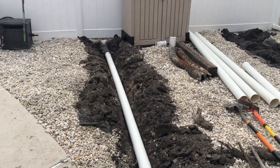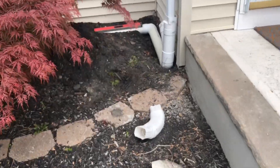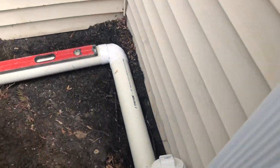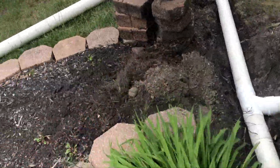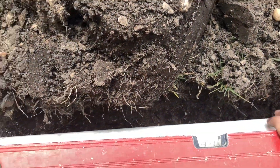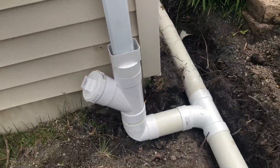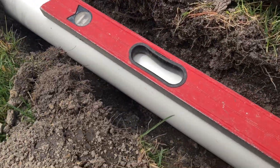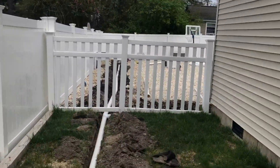Everything at the end is burrito wrapped. Now for the left side — I have the whole left side piped up. Starting at the furthest point, we've got the front downspout with everything going downhill to level, snaking behind all the trees. We've got it all downhill to level, with everything teed in at the directional tees. From the corner going towards the back, we are slightly downhill to level with a long way to go.